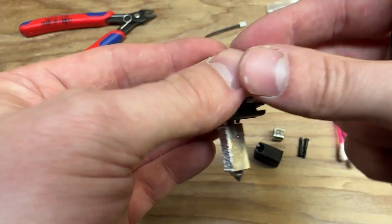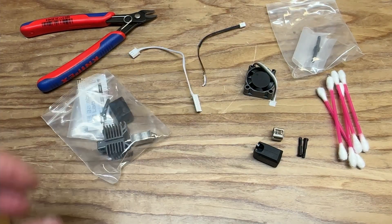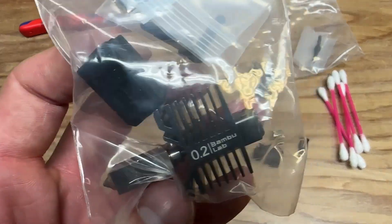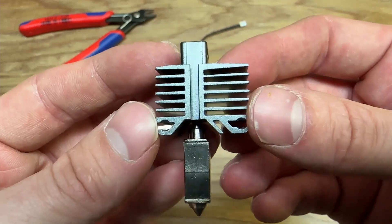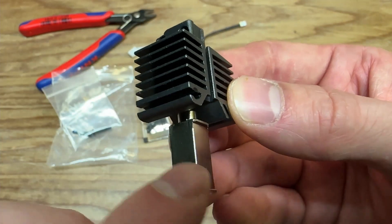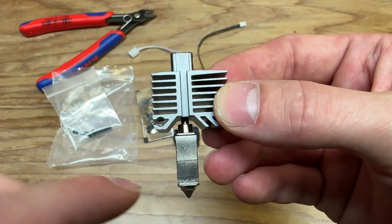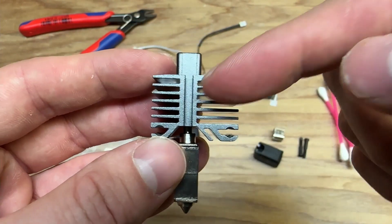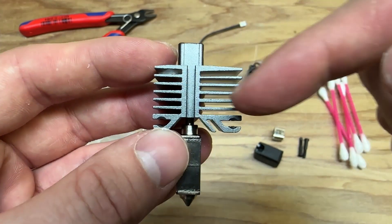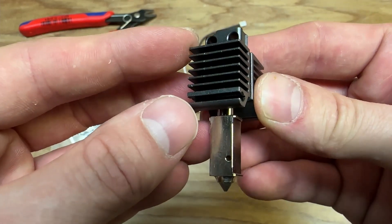This one's a 0.4, and we'll swap all these components onto the other hot end, which is a 0.2. There are a few locating features on this hot end: there's the thermistor hole on the left, so if that's on your left, the face facing you is where you want to put the ceramic heater. Also, the larger fins are going to be on the right, so you know where you are and have your bearings.